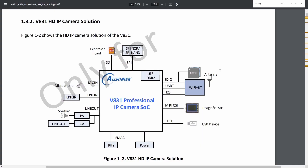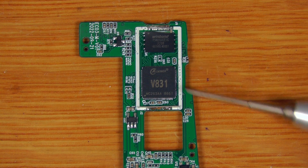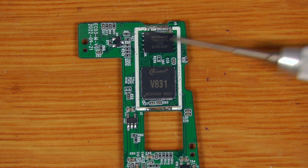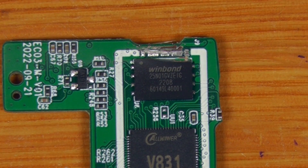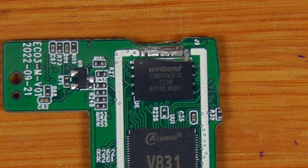For those who want a really deep dive, the next steps on this one would be to pull a chip like this out and see whether any of the debug communication or other interfaces are still active, because occasionally these things do get left on by vendors. This chip here — Winbond — is just the flash memory. If someone has the time and inclination to go into this in more depth it'd be really interesting to see what's inside this chip. In this instance, since this one was sacrificial, I accidentally whipped the corner off that chip while opening it.